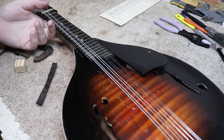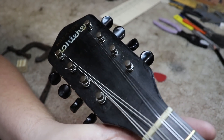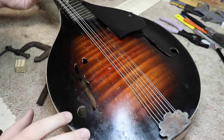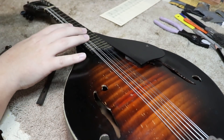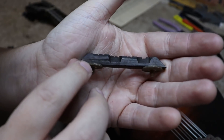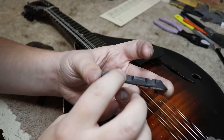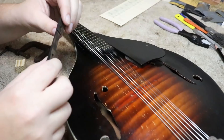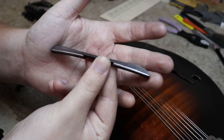This is the mandolin that came in with the little Harmony Supertone - a Harmony Monterey. I've already done quite a bit to it. It used to have a lot of raw wood showing. It's been dyed black and I put some boiled linseed oil on there - it almost has the same shininess as the rest of the finish. I've lightly touched the frets with the file and recrowned them. The biggest problem was the bridge: this whole section was broken off. I took what used to be the broken piece, glued it on, cut it off, filed it all down to match, and dyed the whole thing black. You can hardly tell there's an add-on.